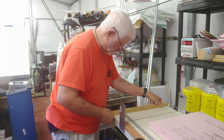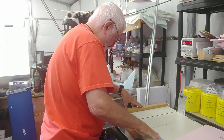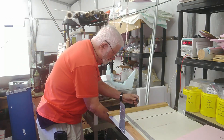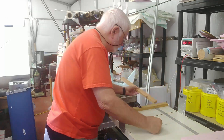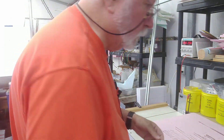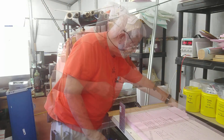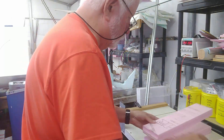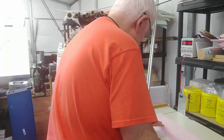I'm just making some measurements to space out the end block to help with measuring. Once this is done, just start slicing away. It's really quite important to make these measurements as accurate as you can — these blocks need to be cut very accurately to make sure everything lines up properly. Once all the cuts are done in one direction, you set up the table and get everything ready to cut the other direction. I cut the narrow width first, so now we'll be cutting the 150 millimeter dimension of all these blocks.